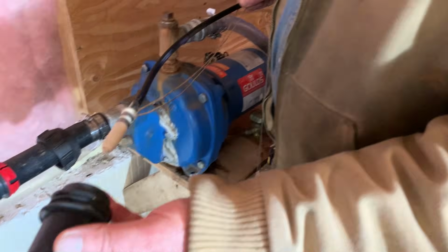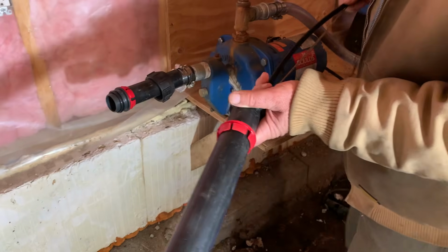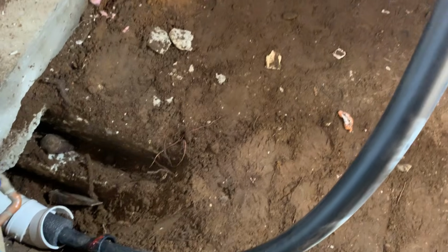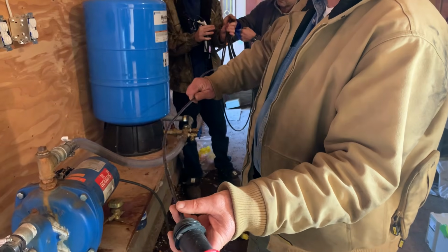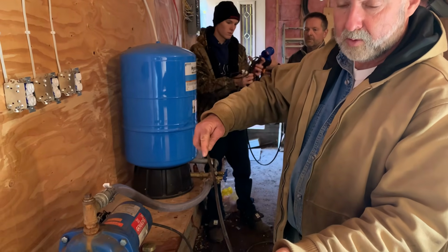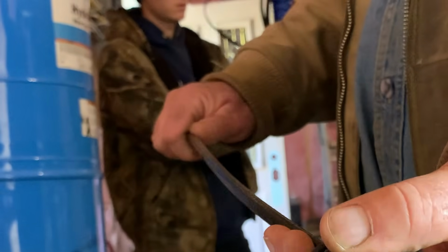Now it's the fun part. We're installing the electric heating cable inside the water intake line. So this puts it in a really good position to keep the water from freezing. This is the same pipe that you saw outside with the insulation and the encasing white pipe on the outer side. And this cable goes all the way through to the well. And it actually is going to come out of the pipe and then go down the well for some distance.